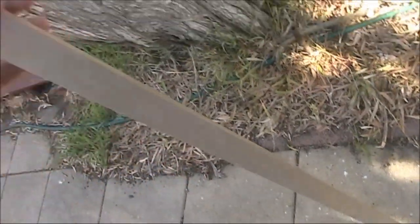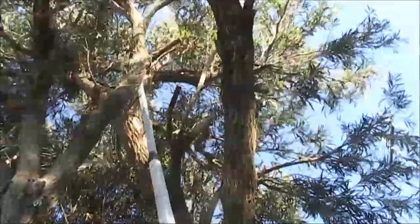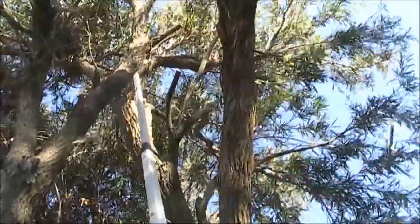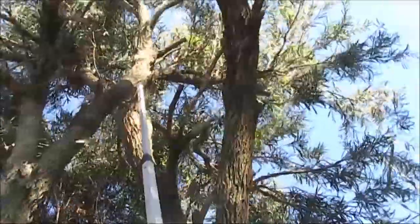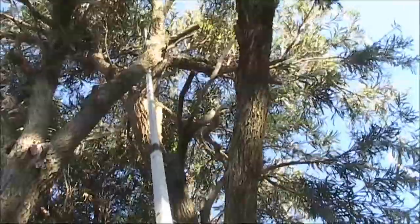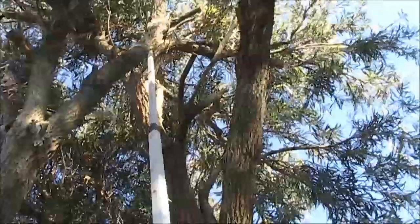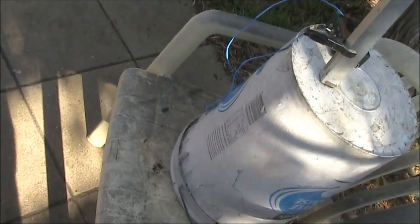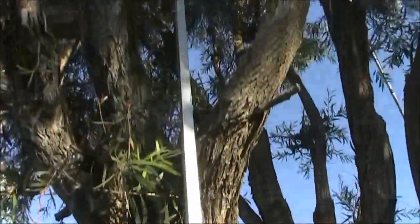This is the vertical, which I haven't yet properly made. It's square-section aluminium, about 25 millimetres, then it goes up into a thinner bit, up into the canopy of the tree. It's about 5.5 metres long, which puts it a touch over a quarter wavelength on 20 metres. I'm not going to worry about trimming it exactly to size, because at the bottom I'll have an antenna coupler that can do that job. When you're using ground planes, I've been told it's a good idea to have it a bit above the ground so that at least some of the antenna clears local obstacles.